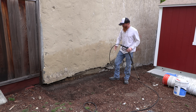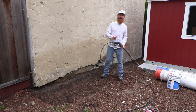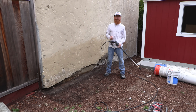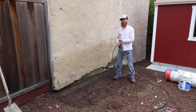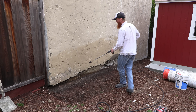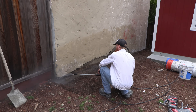Whatever your issues with your stucco or foundation, the process is usually very similar. We pulled back all of this dirt. We are going to clean the stucco with a really strong pressure washer, apply a bonding agent, and probably hang some new mesh wire with concrete anchors — tap cons — so that our new stucco will adhere. We're going to build this out to where it's true and plumb. So to begin, you get your big powerful pressure washer and clean the area very thoroughly underneath.